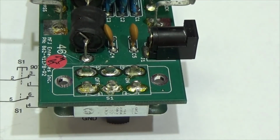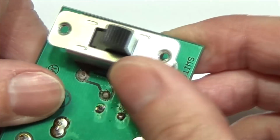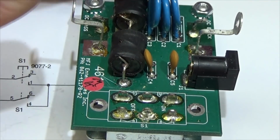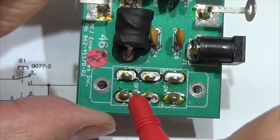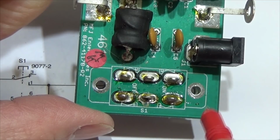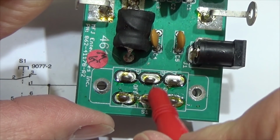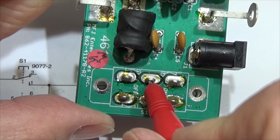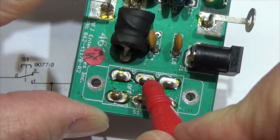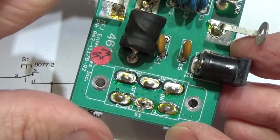Well, before I take it out, there's another thing which is a little bit odd. The switch is in the on position, which means voltage would go through, and a normal switch would work in a way that if it is switched off, these both pins would be connected, and if it is switched on, normally these both pins would be connected. So normally you would put your supply voltage in the middle, right? And then if you switch it to that position, you would get your DC to that pin, which then of course would feed your circuit.